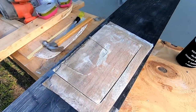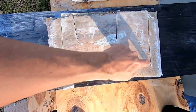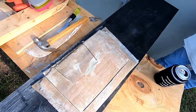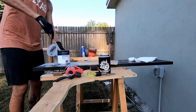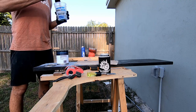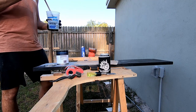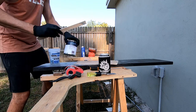As you can see, these are the parts that I cut out off of the boat. I laid them on a very flat surface and taped them together. I'm going to fill all these little areas with the Total Boat polyester structural repair putty. Hopefully it'll be strong enough, plus a few coats of fiberglass sheet over the top. This stuff's really cool — all you do is mix it with hardener, apply it where you want it, and it hardens up pretty quick. It's structural repair so it bonds unlike or like surfaces together, which is why I decided to use it here to get these joints back together. Since it's fiberglass on fiberglass, I figured it would make it even stronger.